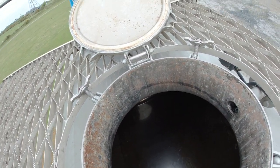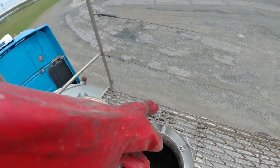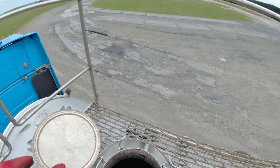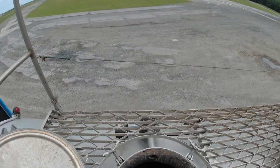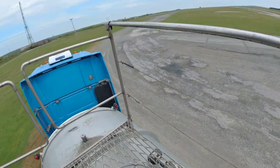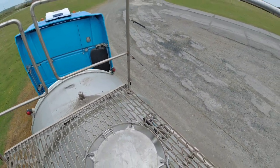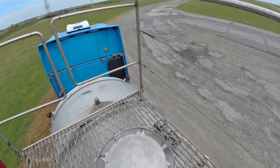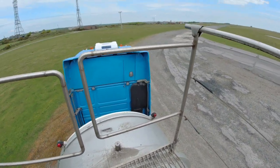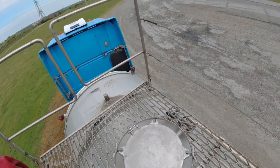When you open it up, it sits like that. You always want to check the seal — it's okay, still functional. Inside you can see the echo in the pot. I opened this one so you can also see the breather valve from inside — that's another way to inspect it. To close: you move them up and spin it around, tightening it so you get a good seal. Do them in opposite pairs — tighten this one, then the one opposite — ideally doing crosswise pairs.